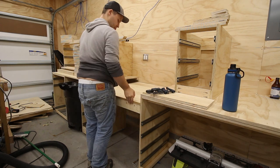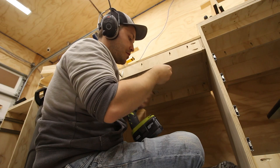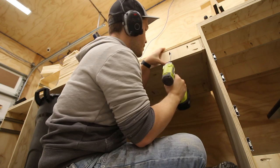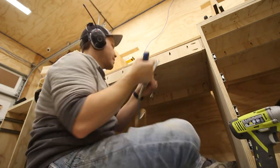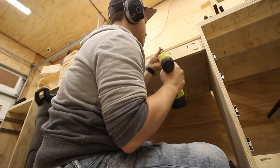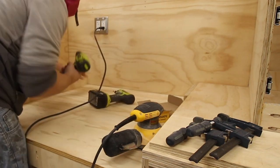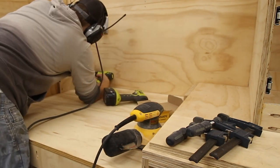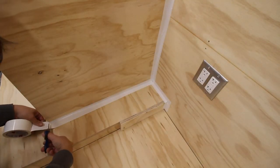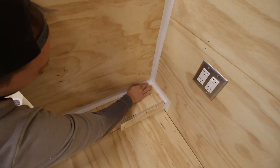After cutting the actual miter saw surface, I could secure it in place from below with the pocket holes drilled upwards on the front and back of the frame pieces. It's worth noting that Jay cut a hole in the back of his board for dust collection, but I haven't quite decided how I want to run my dust collection port to the miter saw station yet, and I'll realistically likely come from above, so I'll drill that hole when it's needed. After a few sideboards were added to each side, it was time to seal the dustbox's seams with some duct tape, which will help create a negative pressure draft into the dustbox to keep fine particulate out of my face while cutting.